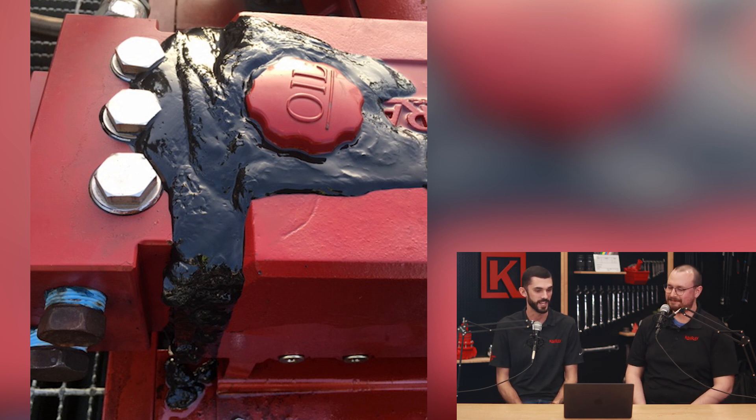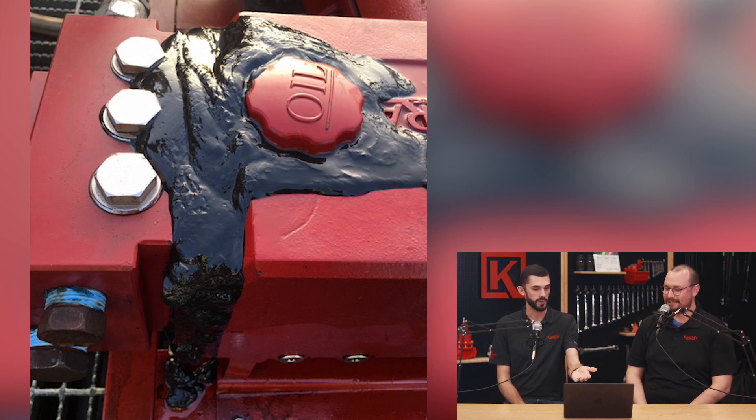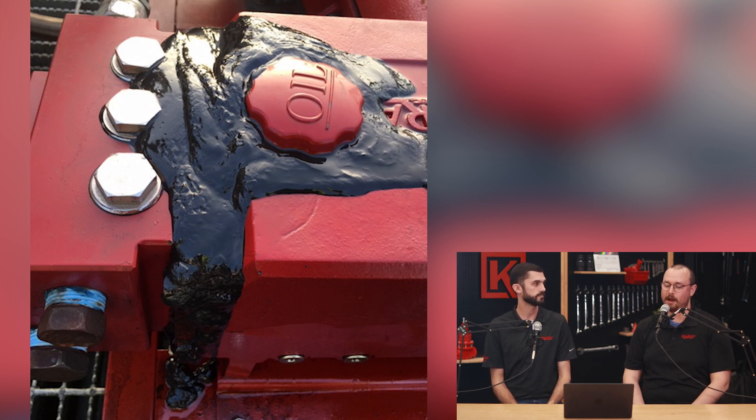Full disclaimer - that's a guess, we don't know. It looks like they caught it pretty quickly though, because it's not a huge mess. The pump's relatively clean - it looks like it probably just happened, maybe on startup of a repaired pump, so they were able to immediately shut it down. If this were to come through on the application end, one of the first questions we'd ask is: have you torn it down? What do the parts look like inside? Is there internal damage? That would help lead us toward finding a root cause. A question I always ask too is: was it ever working, and what changed from the time it was working to the time it stopped? That's usually where you can find the answer.